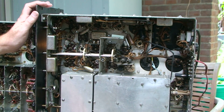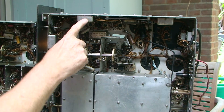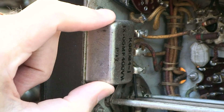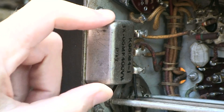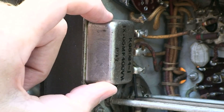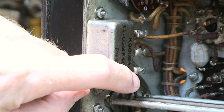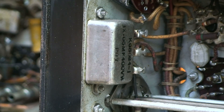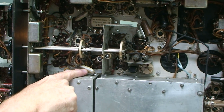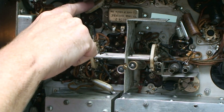This is the Canadian version — the low-frequency version. It has its bathtub condensers marked 'made in Canada.' This is an oil-filled paper type — higher quality than the general ones, with more capacitors combined in one unit. Here there are three connections: three capacitors, each 0.1 or 0.2. It also has a couple of very special shapes you hardly ever see anywhere else.